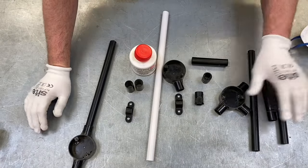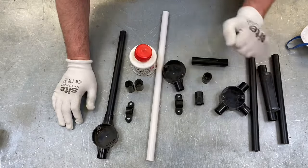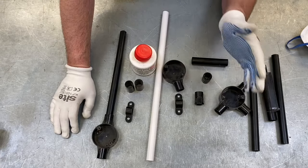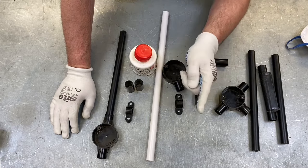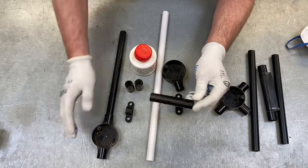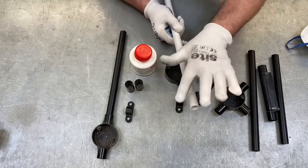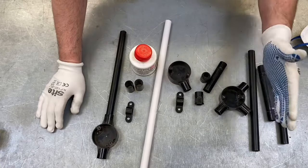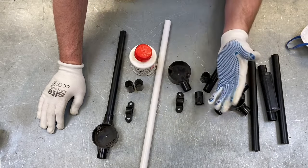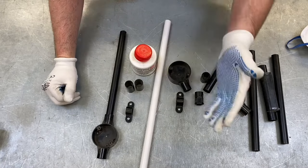That's a whistle-stop tour of some of the accessories you'll see within my notes, in the electrical workshop, and in practice on site. Get familiar with them and with the sort of things they'll ask under examination conditions: sizes of conduit — 16, 20, 25, and 32 millimetres; how the expansion coupler works — fixed at one end, free to move at the other; applying adhesive to the conduit itself and not inside the box; two standard colours — black and white; and the requirement to install in ambient temperature above zero. These and more will be discussed in my notes and workshop sessions to prepare you for installation theory and working life.